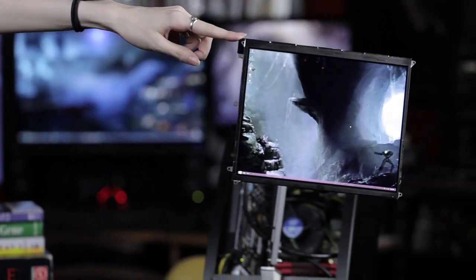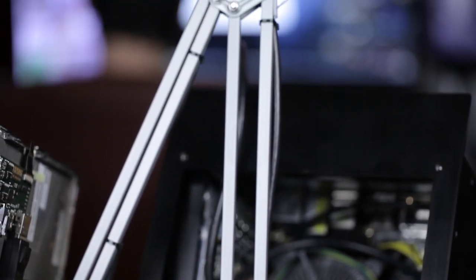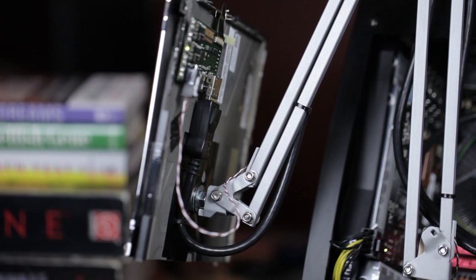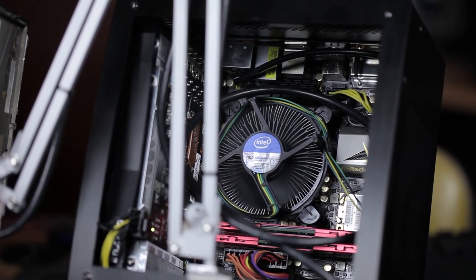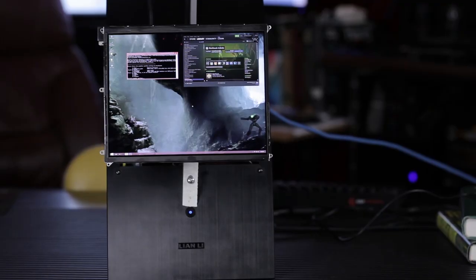Let's talk about what technology we have going on here. You've machined some things together. This is like an old table lamp, similar to the table lamp you would see in the Pixar intro animation. Taking it apart — what is this, like a little piece of plastic right there, like a plastic triangle? This is really just in prototyping mode, so it doesn't look very good. My original intention was to cut down the lamp arm to actually fit inside the case, but that would hurt the reach. It's really just some lamp parts, some scrap aluminum, an old laptop lid cut down to size. The LCD itself doesn't have any backing, so if you try to mount it or move it around, it'll just shatter — it's very thin, it's very fragile. So we're using a magnesium substrate for that LCD, which was the back of a laptop. It was the Dell Latitude something or other.